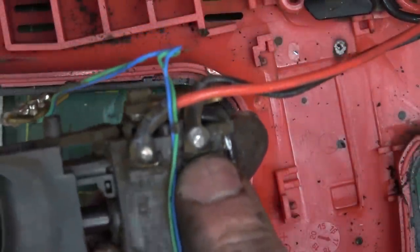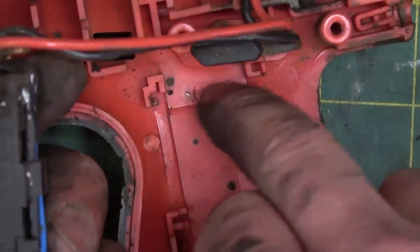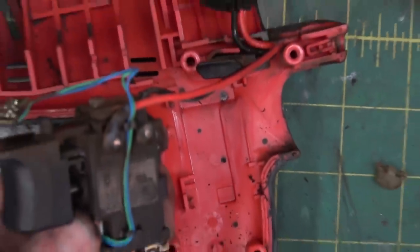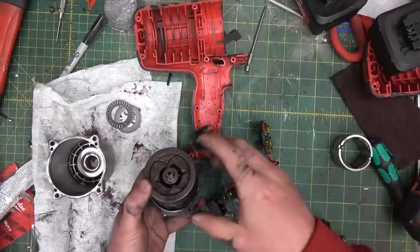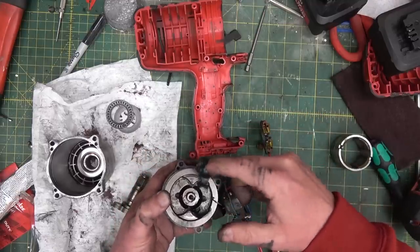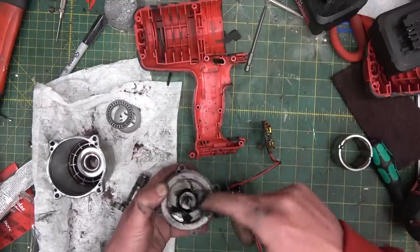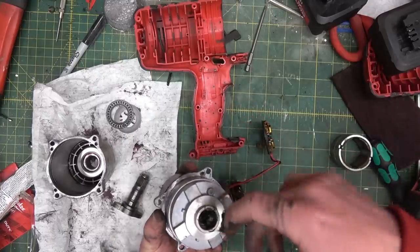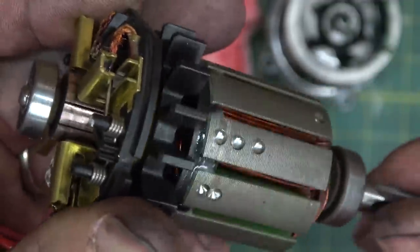You can also see the electrical connections are a little bit tight in there and have been fretting quite a bit. Luckily this casement isn't conductive, because otherwise it'd short right out. But get enough conductive dust in there and that's one of the failure modes. Chances are the switch is going to crap out before it ever arcs across at 20 volts. We won't know if we fixed it until we know. I'll put some light grease — not real tack — on the hammer, mainly going to fling off anyway. Then we'll put some fresh grease down in the borehole. You can see it's picking up that graphite already — that's a good conductive lubricating layer. When it gets too thick or burns into the comm bars, that's when you get the high resistance.